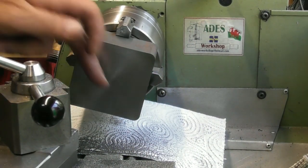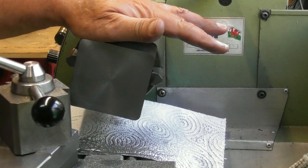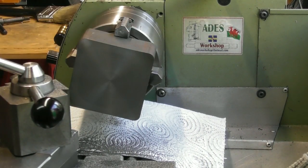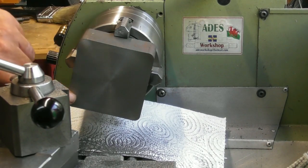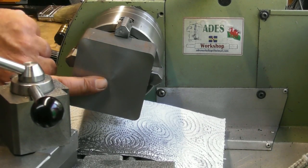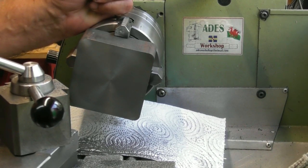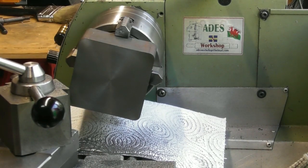I've just finished machining this — it took another 0.1 and it's now flat. I did a scratch pass back and forth and it's as flat as the facing operation of this lathe will allow. Now, if there's any misalignment in the carriage on the bed, and the travel of the cross slide, it could have put a dish in here — it could be hollow in the center or domed in the center. So I'm going to put it on my surface plate and have a look at it, check for any rock, just to verify we've got a good flat surface to start with.